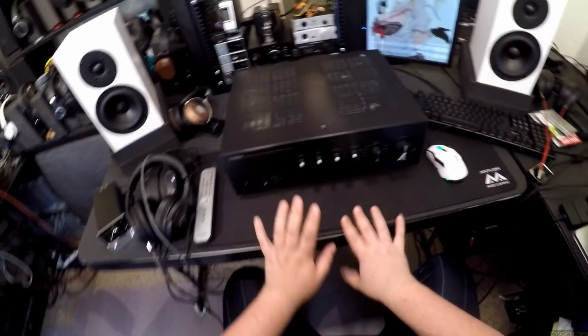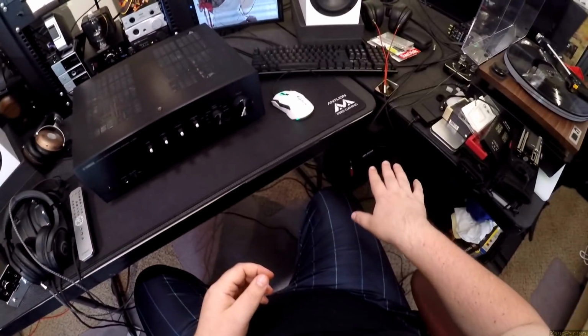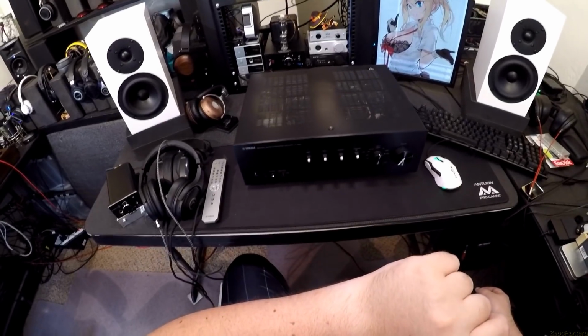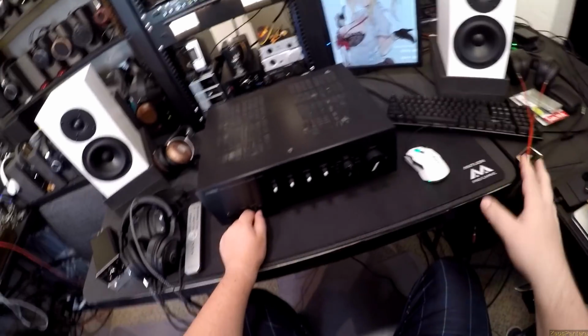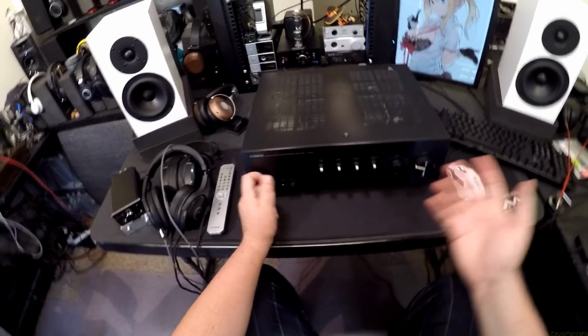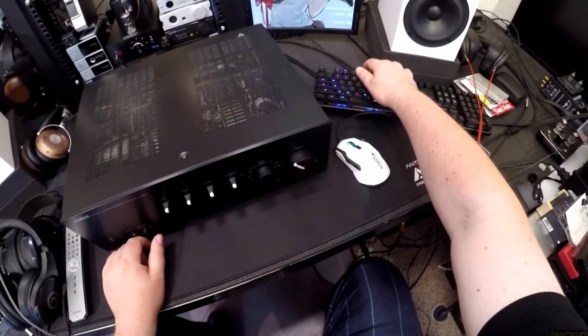Another thing you could do with the B channel output is if you have a subwoofer like, I believe, the BIC F12 had, where it's just the 4 speaker level ins, you could run a pair out to speakers and then another 4 speaker wires down to the sub, and that way you could switch. Like, I can literally turn the sub on and off because I have that foot pedal, because it's a fucking Mackie. If you wanted to run speakers and a sub and then occasionally shut them off, you would do A channel speakers, B channel sub, A plus B you'd have it with a sub. So you'd never run just a sub on its own like this currently is doing.